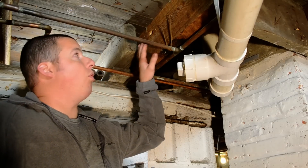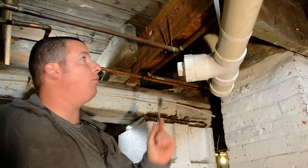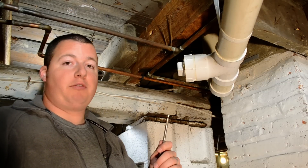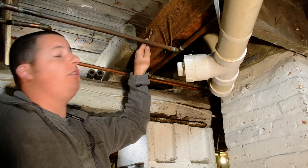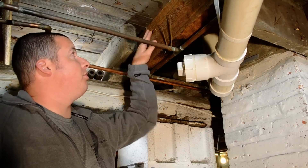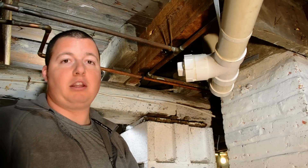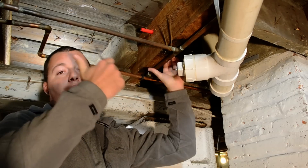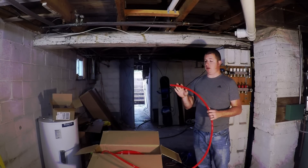The next thing we need to do is drill holes in our floor joists — I've already done this. Use a three-quarter inch bit for half-inch hose; it gives you a little more play to make running the PEX easier. If you have a nailed-down subfloor, make sure your hole is at least two inches down from the subfloor — I ruined a wood bit by hitting a nail. The reason you go through the joist instead of under it is the PEX doesn't bend as well. You'll just come through here, start your next loop, go through your next joist, and keep going. Now that you have all your holes drilled, it's time to run your first zone of PEX tubing.